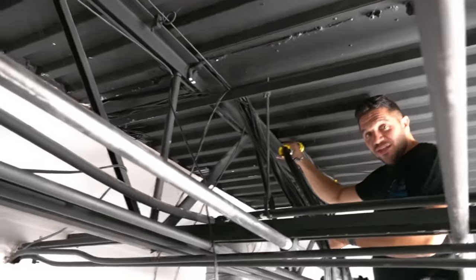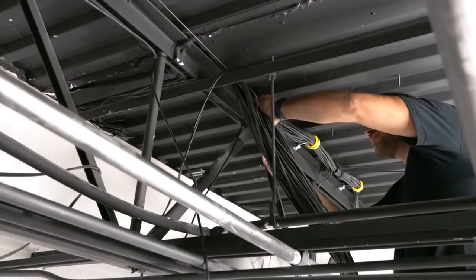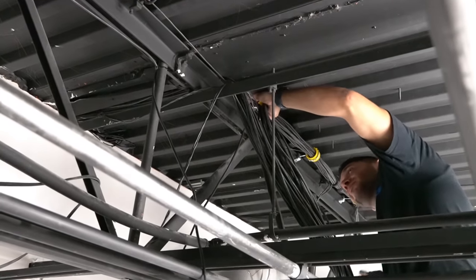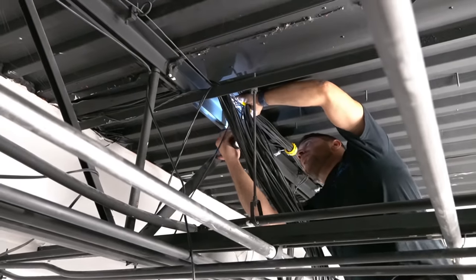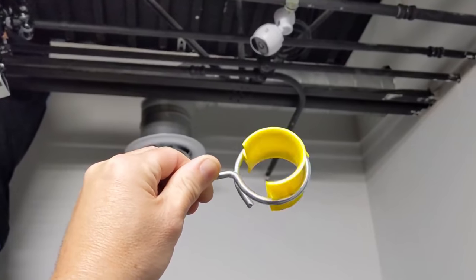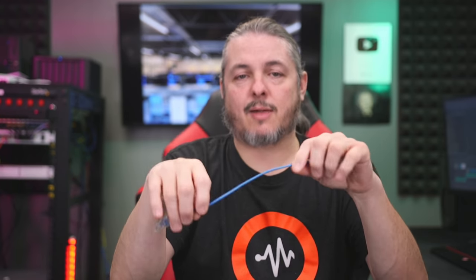When it comes to putting all the cabling in, we first make sure it's supported properly. Please never just lay cables everywhere on top of things. If you have the choice — you're doing nice new construction, not just dragging a cable across for a one-drop — take the time when the budget is there to do it right. This was done properly. We used J-hooks and bridle rings, and specifically the bridle rings we use have a series of plastic rings in them. This is to prevent any problems with radius bends.